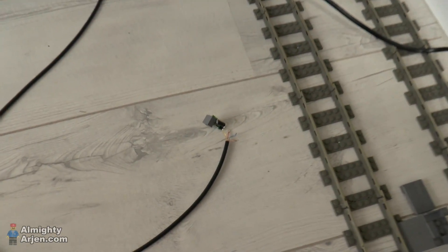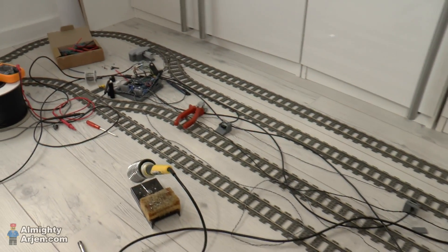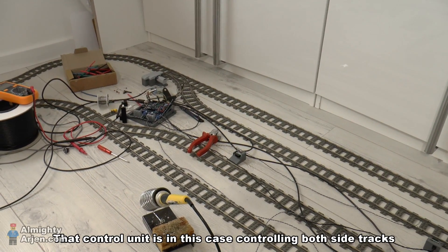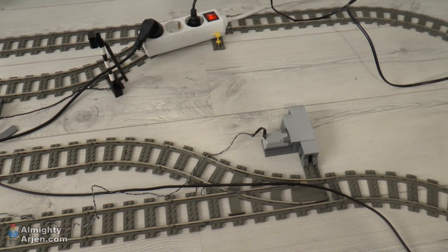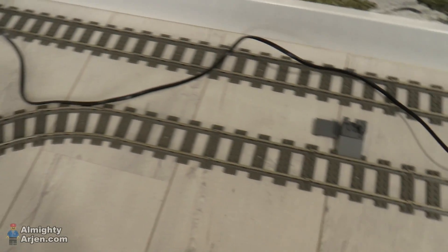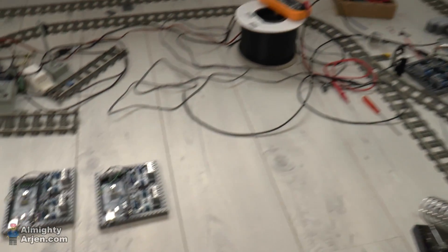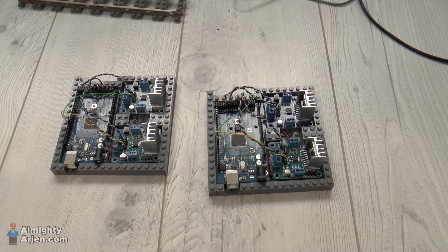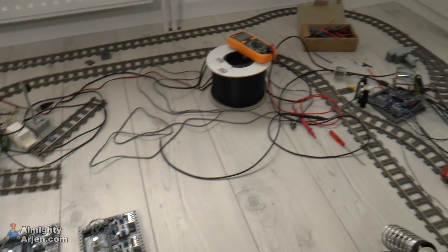Since I've already tried several things and it's difficult to make it all work, what now? There is one option: split that control unit into two separate units — one over here and another over here controlling this track. That means the sensor wire length from each control unit would only be about one meter, which is enough since all the other sensors at that length are working fine. The downside is I've already constructed the control modules for the other stations, so I need to throw away days of work — and time is not on my side.